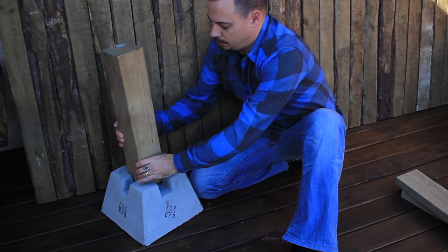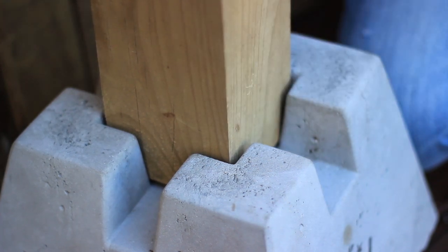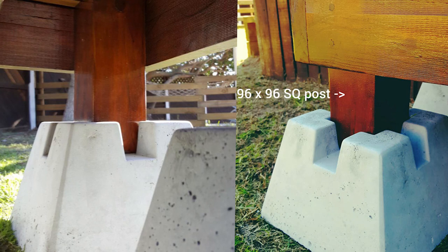The Reka Block is also designed to take a 95x95 post. This comes into play when you want to elevate a deck or if you have a sloping deck where the ground slopes off. You place the 95x95 post into the center of the beam, slot it in, and then join it up with the side timber — either 50mm or 38mm material, depending on the size of the deck you're building.